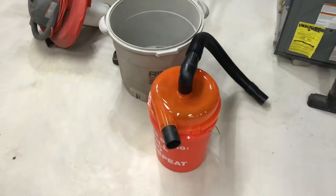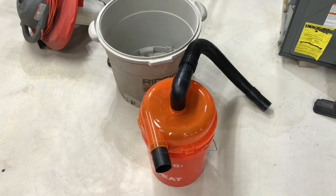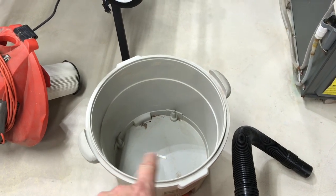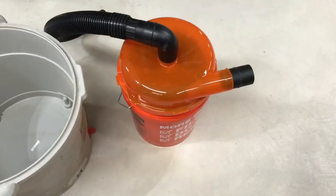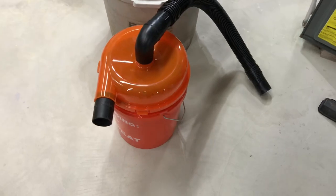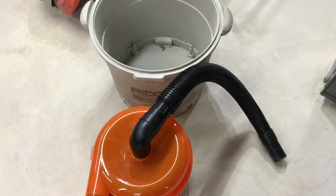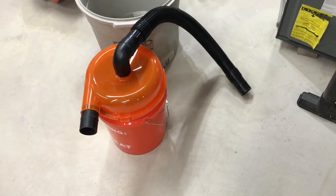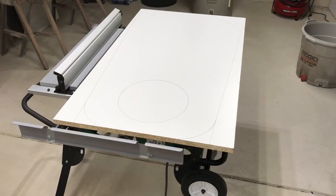Here's the configuration I'm thinking: I'll use a piece of melamine, cut a platform for the bottom, attach four wheels to it, shoot some sheet metal screws into the melamine with silicone for a tight fit, and leave the tool holder on the back. I'll cut a hole for the five-gallon bucket to fit snugly in so you can remove it easily. The hose connection is too long so we may need different plumbing parts or to cut it. Let's make the base first — one thing at a time.